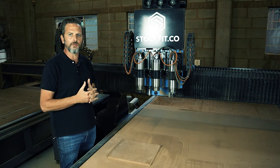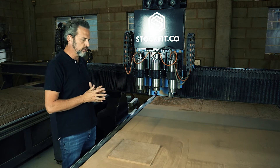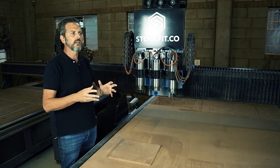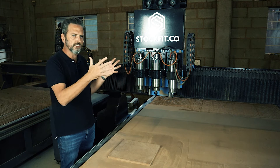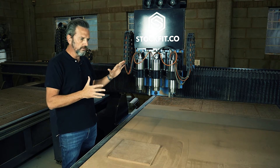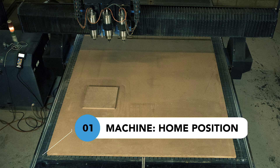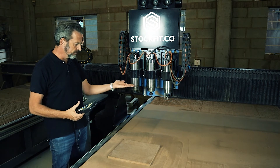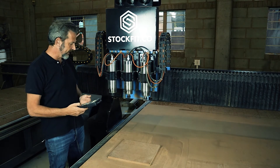There are a couple of small factors that confuse people. The first thing is when you switch the machine on, it will automatically find its homing position — the machine's zero-zero position. Basically what that means is it calibrates the machine and says, okay, these are my limitations in which I can work. In our specific case, this machine homes to the left front corner, basically where I'm standing. If I hit the home function, it'll lift the heads up and move towards me into the front corner — that is the machine's basic homing position.